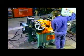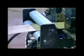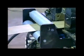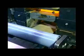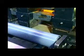There are several hundred zip welders in use throughout the world. After the tail end comes off the uncoiler, it is pulled up to the zip welder and stopped in the shear area. Stopping of the strip can either be done manually or automatically. Once the tail end is in position, the operator closes the exit side guide.